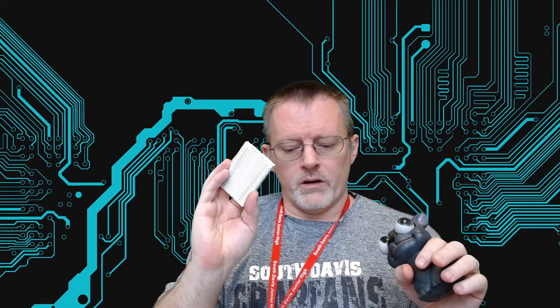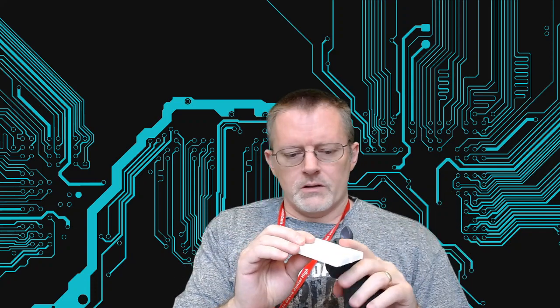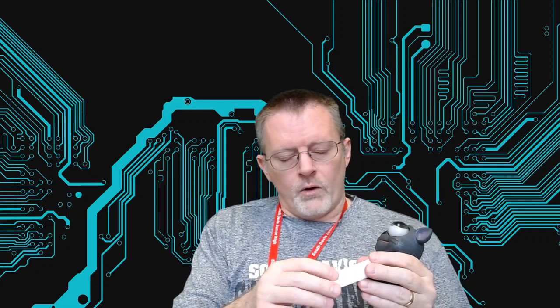The circuit layout, the actual construction on our breadboard, will be very similar to what we've done in the past. We're actually going to introduce a new function today. Up to this point we've learned pinMode, we've learned delay, and we've learned digitalWrite. And the new one we're going to learn today is analogWrite. So we're going to be focusing on some new code and not so much on some new circuits, although we'll be making some and you'll get more practice, and hopefully by the end of this lesson you'll have breadboards down really well.